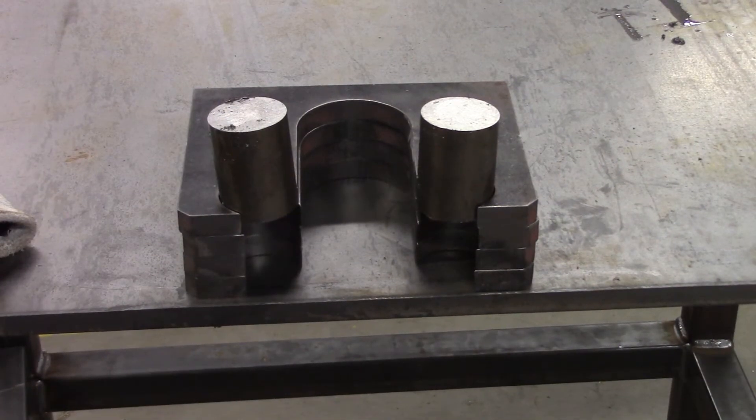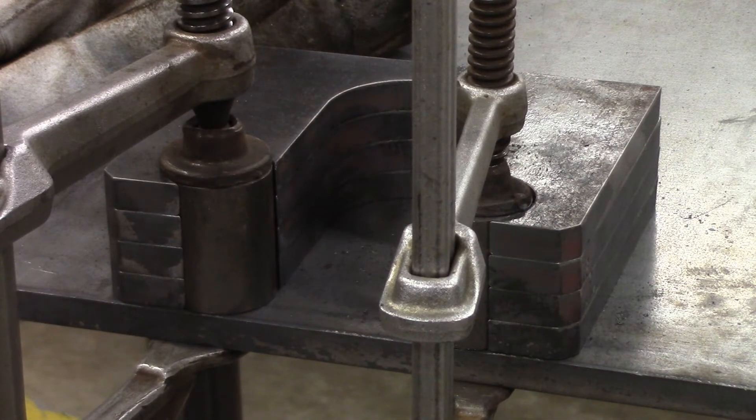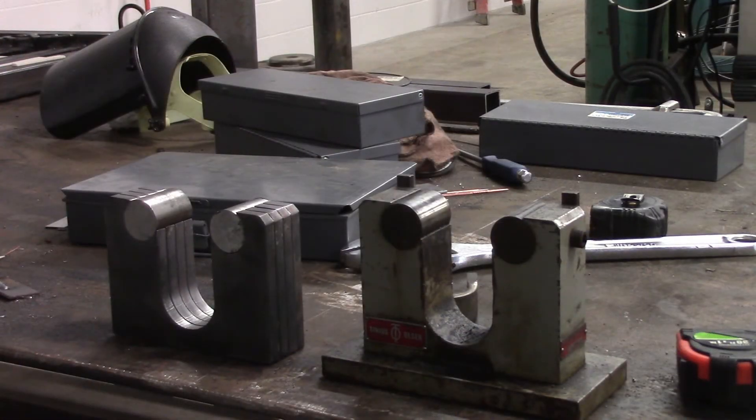We're going to drive those solid rounds right into those little sockets and then tack it up. It worked — it was pretty snug, but that's what we wanted. We'll weld it all up, get the base done, and we're ready for final assembly. Before we tack everything together, we've got one last plasma cut: the bottom plate from the Tinius Olsen fixture, which is four by nine inches. We'll cut that out and then tack this thing all together.